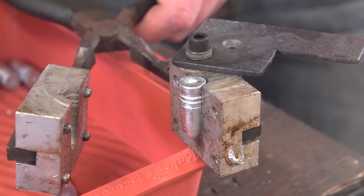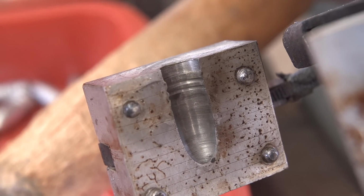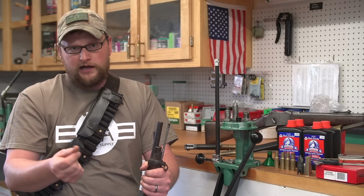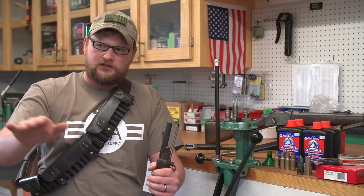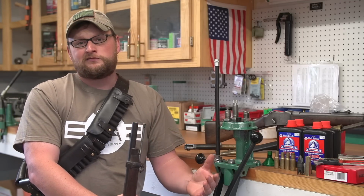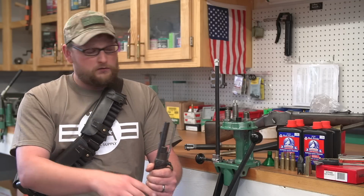The bullet mold that we're going to be using today to cast our projectiles is one that was actually cut by Jen's Boy 2003, the YouTuber, and he made it off of an original pulled projectile. He bought an original round online, pulled the projectile, and then cut his cherry specifically to the shape of the original projectile. So for the purposes of today's video, we're going to be producing the closest thing to the original military cartridge that we possibly can for an economical rate.